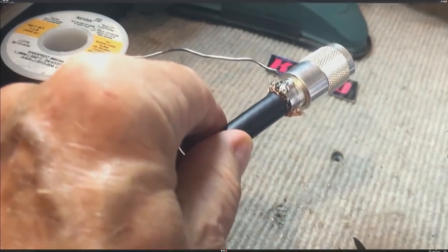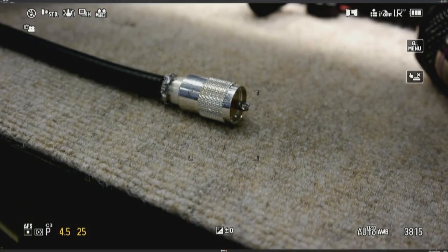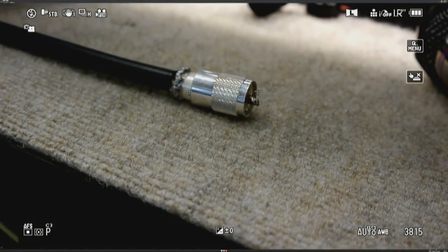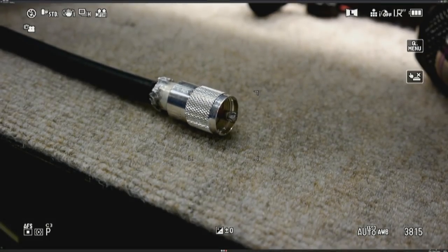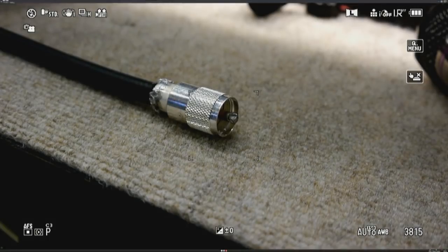As I said, it's been back in the 50s, and it's one of those things that when you're all finished with it, it's a nice looking solder all the way around, and you, by golly, know that all that shield is soldered, not just 4 little holes. And I think that's what I find best about it, is that I never was sure, and you can't be either, that that is 100%. So I don't understand why more people don't do this. And I do it with RG58 or Mini 8 or any of that by using the adapter, and solder the adapter first, and then away you go.